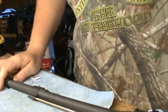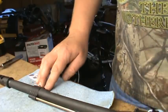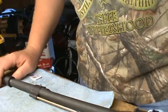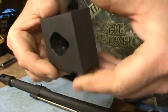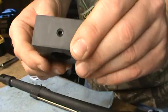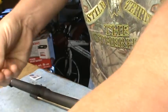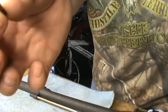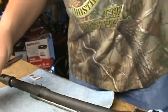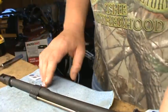It is set screwed and pinned now. I'm going to take both set screws out of the bottom, clean them up a little bit, put a little more Loctite on them, and put them back in there permanently, then go shoot it and see how she does. In case you guys are interested — one more time — BRD Engineering Veltor gas block jig for pinning. You can do it with a hand drill if you want because it's got the guide on it. And then from MidwayUSA, the 2/0 taper reamer that you've got to have. Just make sure you do it from the right side — your pin goes in from this side and comes out from the other side.